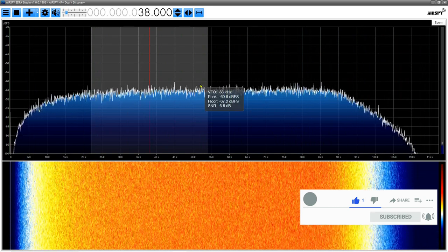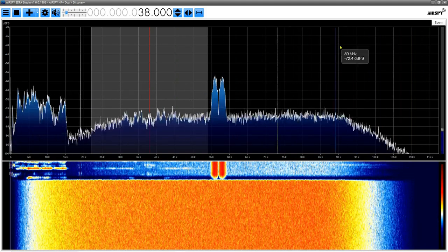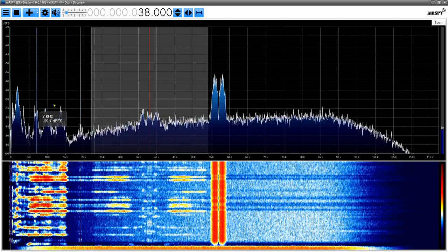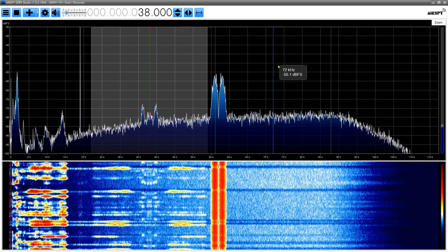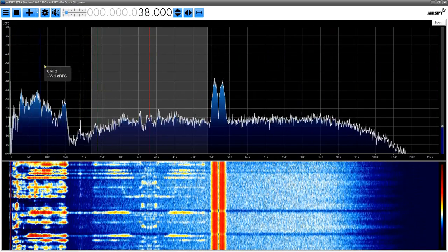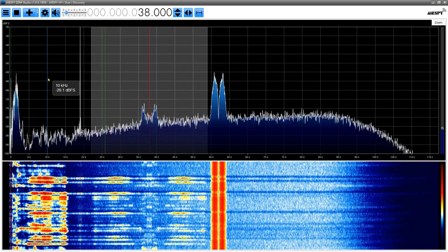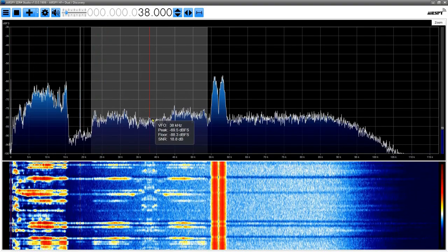So I'm going to turn on the first station here. I'm going to push the memory button. And this is 90.5. You can see I'm centered at 38 kilohertz right now. And the top end is 105, the bottom end is zero. This is your left plus right channel. This is essentially the announcer's voice. And there's very little component over here in the double sideband signal.